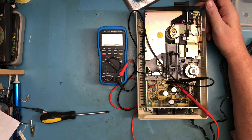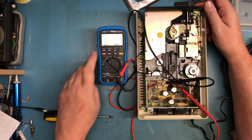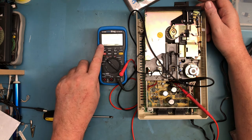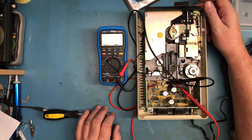And when I click the power off, power's off. It's taken a long time to bleed down, and that's because there's 23 volts coming in. At 23 volts it collapses, so we'll go back and do this again. So power's off, that 23 is now collapsing and collapsing and collapsing. Finally it got down to where regulation ended, and then it rolls off and regulation goes away.